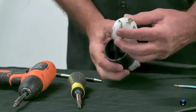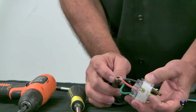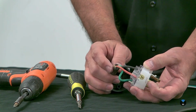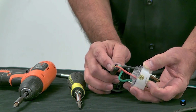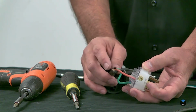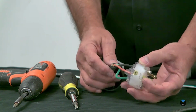Okay, so I'll just slide, and there's my protrusion right there, and there's my groove right there. So turn this around. Now this white wire is cut off in this circumstance right here. So this is a neutral wire. It doesn't carry any current from the outlet or to the machine or anything else. So in this case, this neutral wire on the machine side won't be connected because the machine this 3-prong plug would be used on would only have 3 places to put wires. So in that case, this is a wire that's not going to be connected on either side. If it makes somebody feel better, you can put some electrical tape over that.